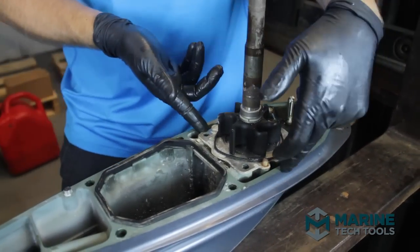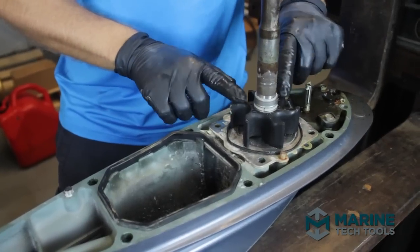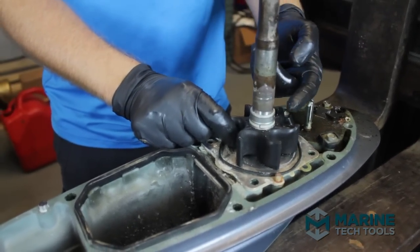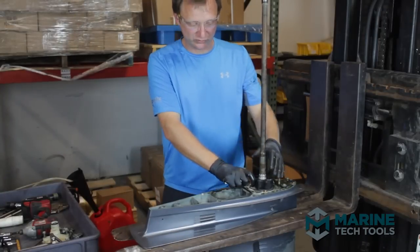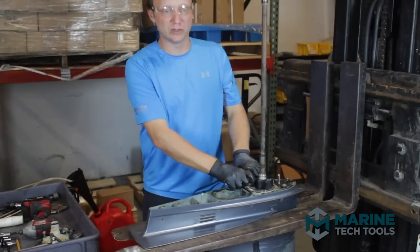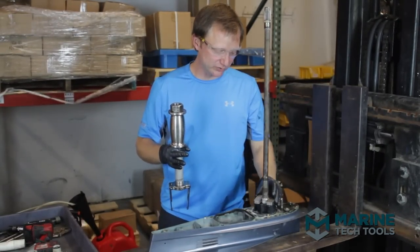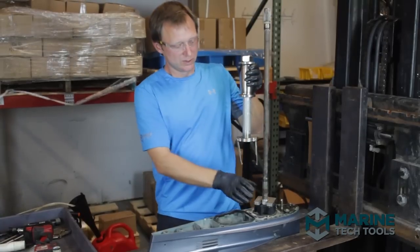We've removed our water pump housing and we're confronted with something that, as far as I can tell, is unique to Yamaha: the driveshaft collar and nylon driveshaft spacer that holds the wave washer assembly on and also secures the water pump impeller wear plate gasket. We need to pull these off in order to finish teardown on the water pump assembly. We created a little insert that slides between the bottom of the driveshaft collar and the small flange on the nylon spacer underneath.